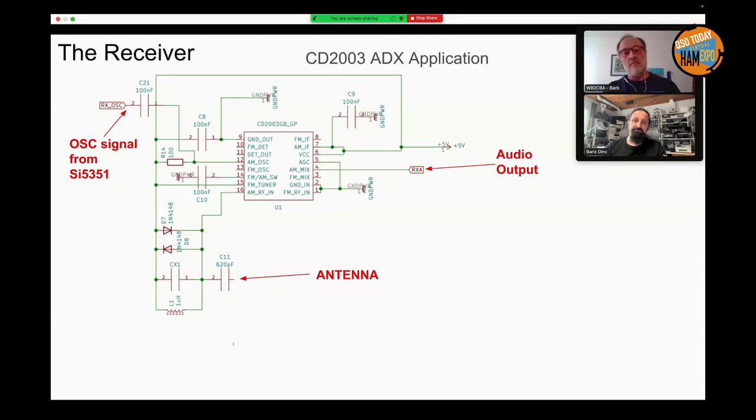As you see, a few capacitors, a few resistors and diodes, and one coil, which you can think, how will I make this one microhenry coil? But it's very simple to build that coil, and it's all explained. It's just winding a wire on a T37, I guess it was. Yeah, T37. Actually, it can be a fixed inductor also. I'll explain it in more detail, but that's just the short version.